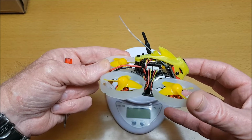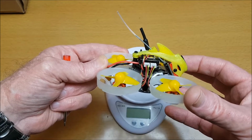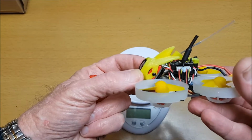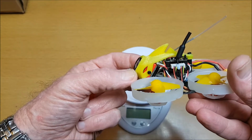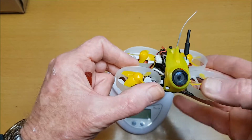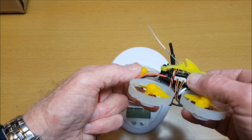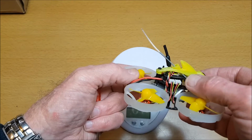This comes with a Full Speed F411 FC flight controller board with Betaflight OSD, 8 amp BLHeli_S 4-in-1 ESCs, and the camera is a Caddx Turtle V2 800 TVL, HD 1080p at 60 frames per second, with a 1.8mm turbo eye lens, and this connects to a Full Speed FSD TX600 25 milliwatt up to 600 milliwatt FPV transmitter.